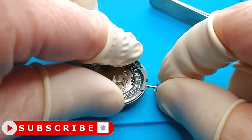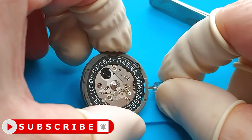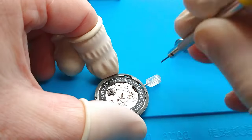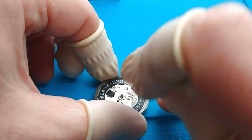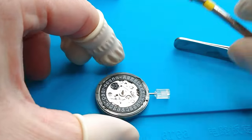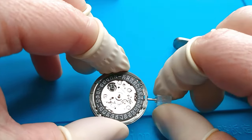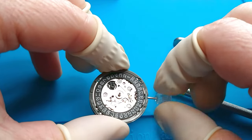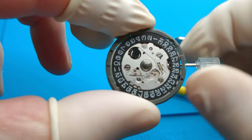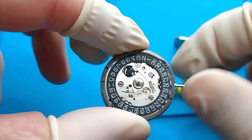We can see here that this ring would have been easier to install before I installed the date dial. Anyway, with a screwdriver I can work through this. What I like about this watch movement is it has a black date dial, so it fits perfectly with the watch dial and the watch will look much better.